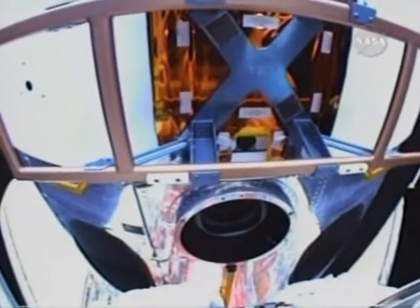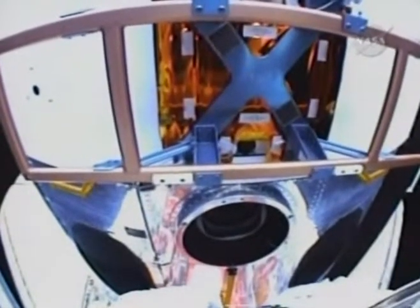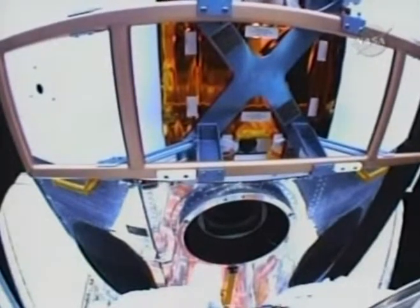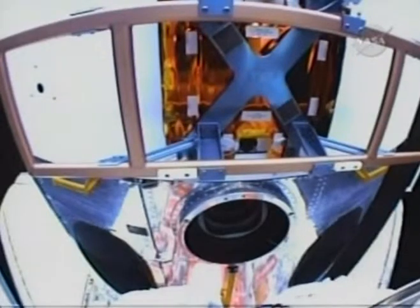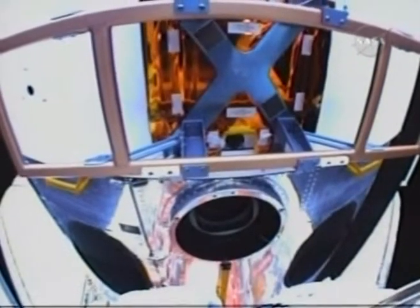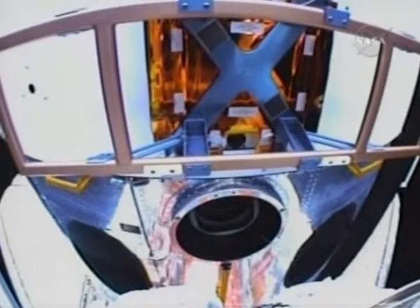Okay, Mass, I just want to understand how far can we go with this, and what are the implications if I over-torque and break the bolt? Sure, you want to know. Houston Atlantis, you might have copied Drew's question. We know the failure torque on this bolt is 57.1 foot-pounds. We had the MTL set at 45. What the crib sheet says is if we don't get it to break here, we're going to reconnect the ground strap and blind mate connector. So I guess Drew's just wondering how hard he should try on this A-latch. If you have any words for us, we'd appreciate it.